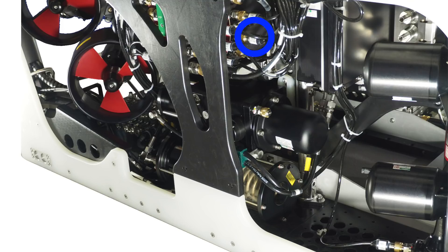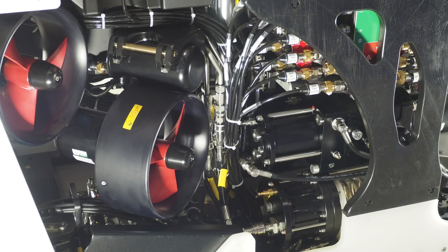The bottle above the HPU is the e-pod. The control and signal lines from the umbilical enter this protective pressure bottle. In some systems this houses a computer with analog interface cards that can drive the lights and thrusters. More advanced ROVs like this one, however, use a distributed control system with intelligence in each of the modules. So each light has its own microprocessor recording the status of the light, its temperature, brightness, and current — all of which is reported to the surface.